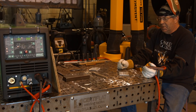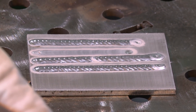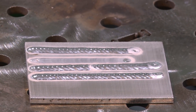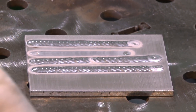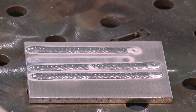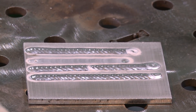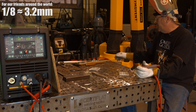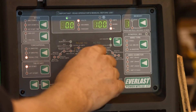That's me long-arcing a little bit there to get back away from it. Super smooth and super clean. I noticed on the bead before this one, maybe I was holding a little bit too long of an arc, but I'm trying to stay back away from it as I'm feeding filler wire. It just quit, so maybe that's me. I want to run some 1/8-inch now and see what happens, and I'm going to change frequencies too.